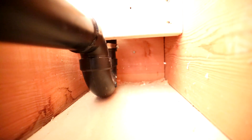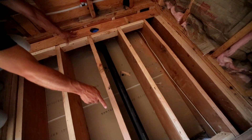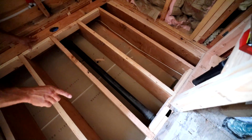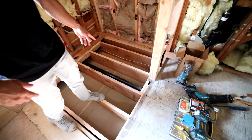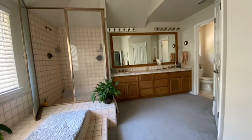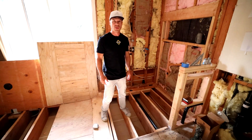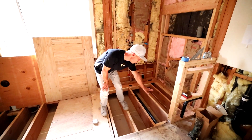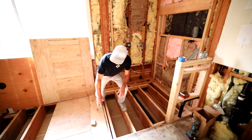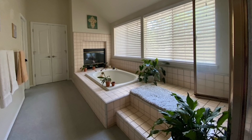We also have our two-inch ABS pipe centered — we've got our trap. This is running off with correct slope down to the trunk line where the toilet is. The plumbing was completely different on this job. The whole thing was built up on an elevated platform — kind of 1980s style where you stepped up into the shower. The old floor of the shower was way up here, so they actually had all of their plumbing pipes running above the subfloor grade with a big jacuzzi deck. We basically had to get all the plumbing down below.